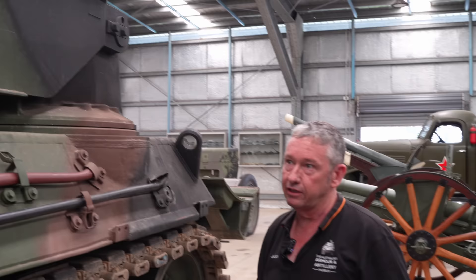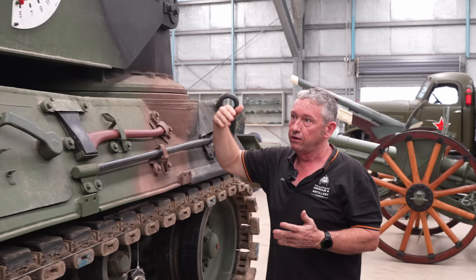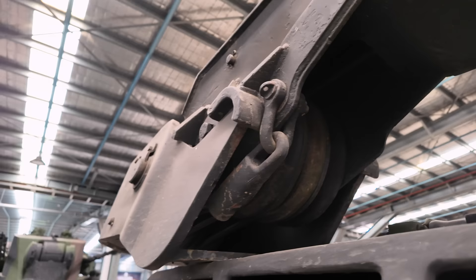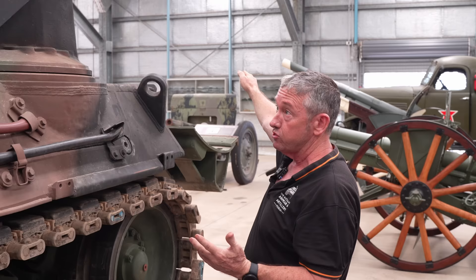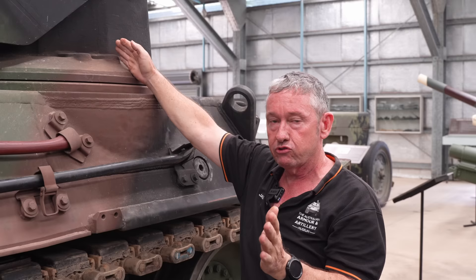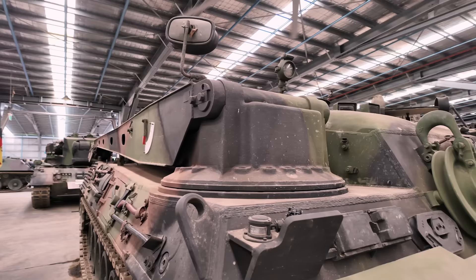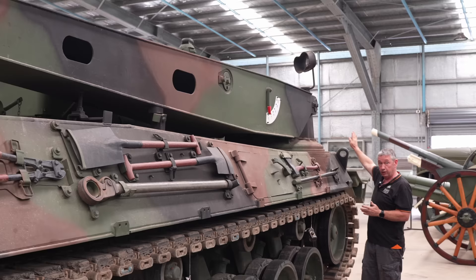This boom or crane can hold a maximum of 20 tonne and has a free-floating swivel, which lets us know how much we can lift at a particular height. The boom has a swivel of about 270 degrees. When we get to heavier weights, that's when we employ the blade — we lower it down and lift the vehicle off the ground slightly for stability. At about 5 metres out from the vehicle we can lift 5 tonne, but that only gives us about 200 degrees of motion. At about 3 metres out — around 13 tonne — we can lift around that 13 tonne mark. But to lift 20 tonne, we've got to have the boom literally straight out in front at 0 degrees, with the blade down.